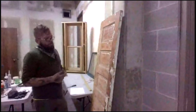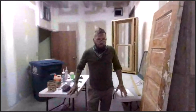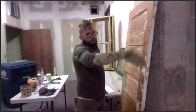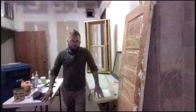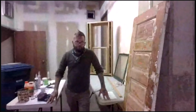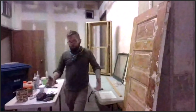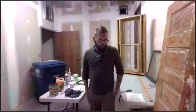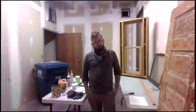But you can also use a product like beeswax that you can put on there. I've used old candles before and just rubbed it on the door. And that actually works surprisingly well. It does. The candle makes a world of difference for me in my hallway with the linen closet. It sticks. And you can use that on your wooden drawers as well. That's a great trick to make those slide properly.